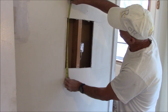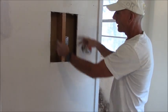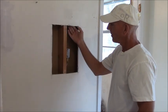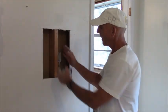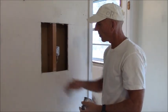So I'm going to cut it right about 21 inches and 21 inches on this side, and that's going to give it this cross support. You could do smaller ones up here, but it doesn't really matter. These are 4 of them, and these are 2, so it's easier to do 2. If you put it up against there, it's going to have a tendency of cocking in or out, just like April just showed you. So you need these at 21.